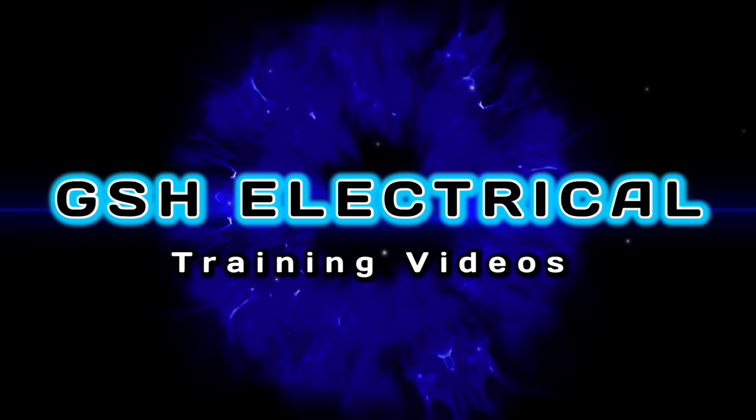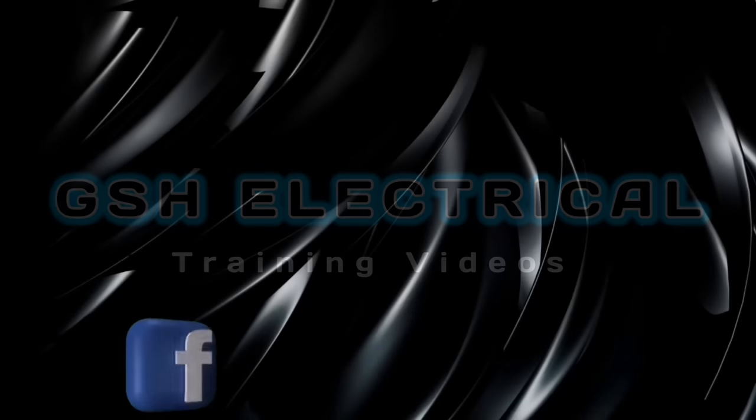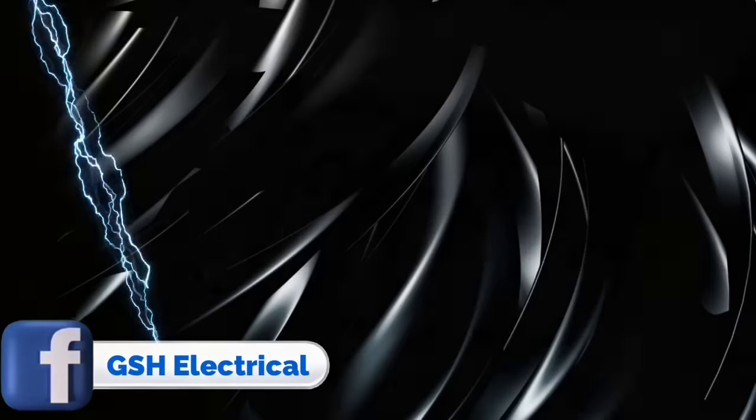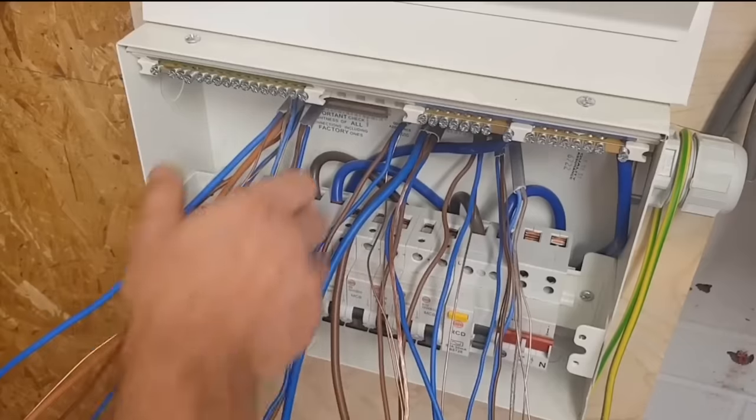The first thing I'm going to say is that it doesn't start like this. Obviously, when I start, I'll have a load of twin and earths coming out the board. Now, I think about where the circuits are going to go first. The first thing I'll do is write down, it could just be on the lid of the new DB you've got, to get the old Wylex cardboard out, and you'll be scribbling down all the circuits.